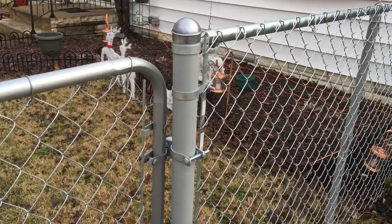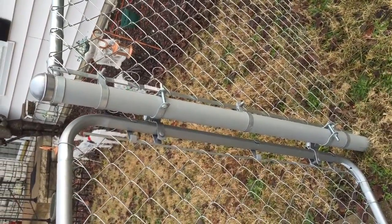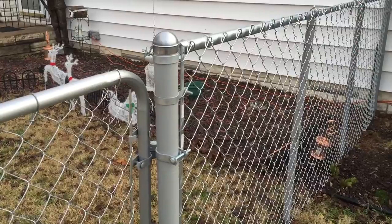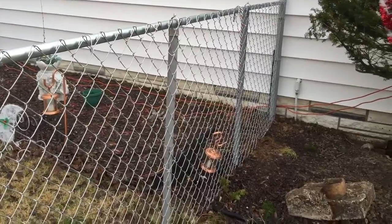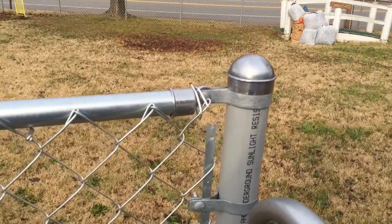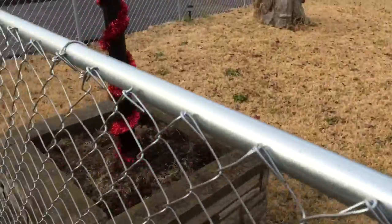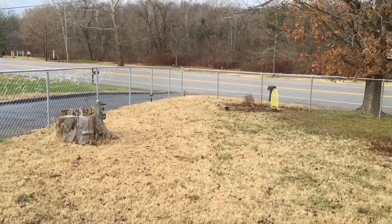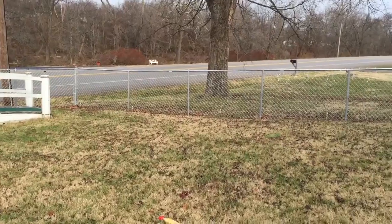What we did here is use plastic electrical conduit on a post instead of metal. The metal end post is like $14 — you can build one for three dollars. On the line post, they're nine dollars and you can build them for about two dollars a piece. Of course, on the top rail you use metal just like regular pipe, and on the end you treat it just like a metal pipe. Everything's the same. You can see this fence worked out pretty good — 50 foot out, 58 foot wide. The plastic pipe works just fine.